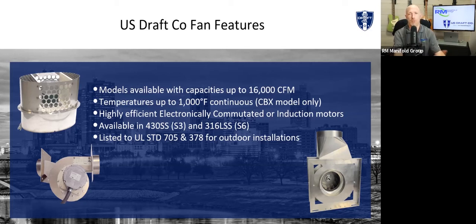Our three-phase motors are all induction motors and we provide the VFD to vary the speed of that motor. All of our products come in stainless steel — most of the time 316L. Most of the applications we deal with are condensing or near-condensing where there's a good chance of condensate in the system. Condensate is very corrosive. Some other manufacturers use cast aluminum housing or carbon steel with an epoxy coating that flakes off after two weeks. We've gone to all stainless steel on all of our products.